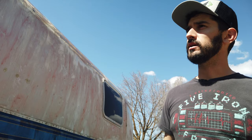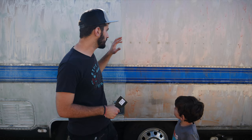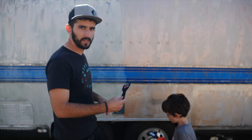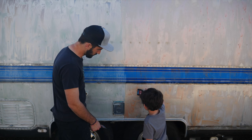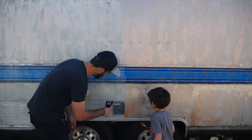We've now waited about three and a half hours since we put this side on. We have our plastic scraper — very important that you use plastic and not metal because you don't want to scratch the aluminum. We're going to give each of these a quick scrape test. Round one: Parker, give the Citrus Strip a test first — give it a nice scrape. Looks like it's working, looks like we're getting some bare aluminum, so that's good. Now let's try the Ready Strip.